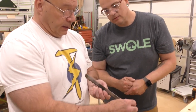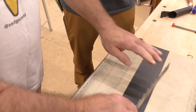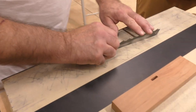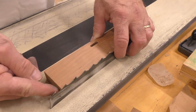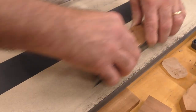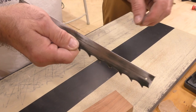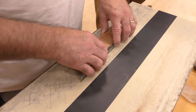Now I'm feeling the top of this and I don't want any nicks. I'll take this and put it just like this, keeping it at a perfect 90. I'll get a 90-degree block. We need to do this edge right here — we did this edge, we did this edge. Balancing this to make it a perfect 90 is a little tricky. This is a trick I learned when I was a young man: take something you know is milled perfectly 90 and bring it on the 120 like this. I'll feel it — all the way across, no nicks. What's one of the best feeler gauges? Your fingers. Come over to 320, just hold it like this and make some passes back and forth.